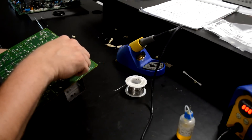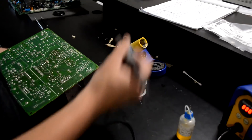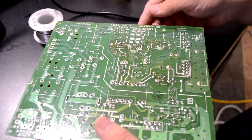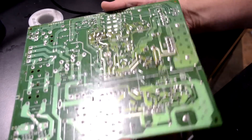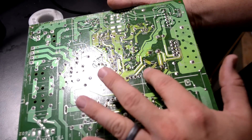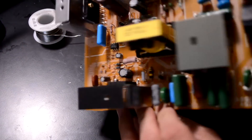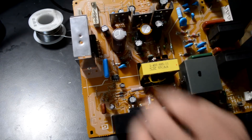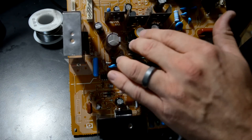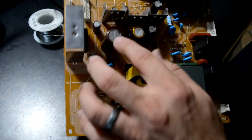You can't just throw it right back into the monitor yet — we've got to clean it up first. I've just finished the caps, but as you can see there's still a lot of gooey, sticky flux left over on this board. So I'm going to go and clean this up with isopropyl alcohol and get all of this off because I don't want it to stay on there and make everything sticky. You'll notice the new capacitors do look different — that's because advancements in capacitor technology over 20 years cause a lot of them to get smaller and more compact.